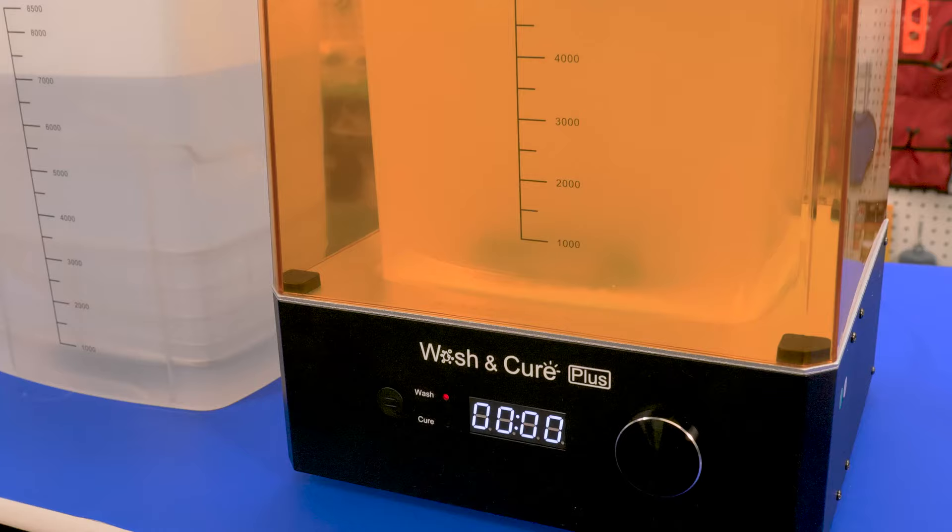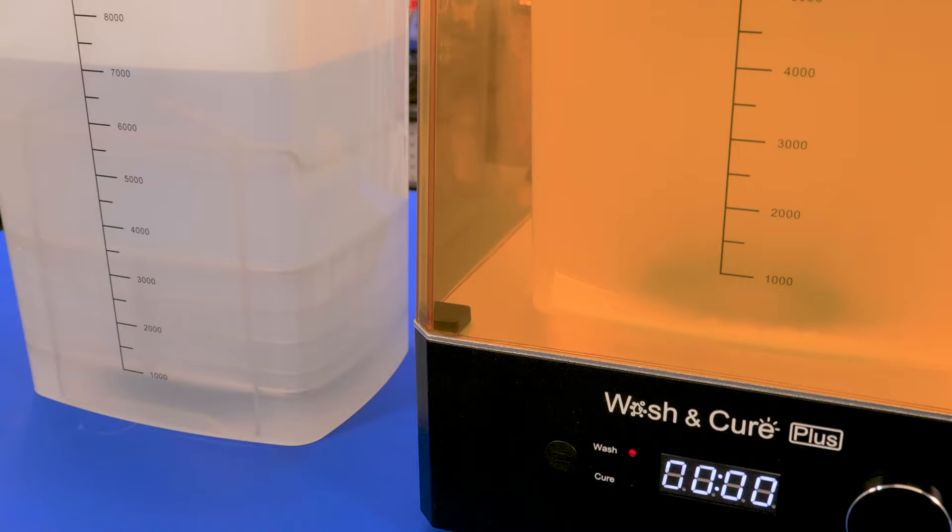This is honestly one of my biggest frustrations in 3D printing. Resin printing requires a good amount of IPA, or isopropyl alcohol, that's used to wash the prints before the final cure. And while there are alternatives available like water washable resin, IPA does such an outstanding job it really remains my go-to for parts cleanup. In my workflow I maintain a two-stage wash process where I have a primary wash and then a secondary wash that's much cleaner to clean up the final parts for curing.